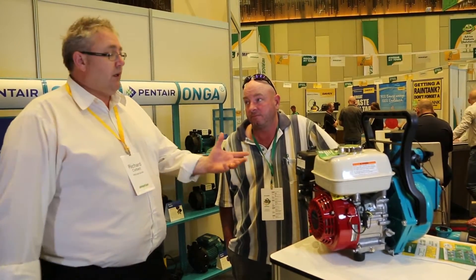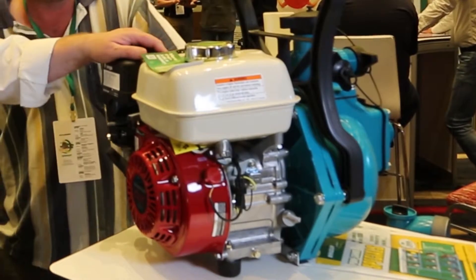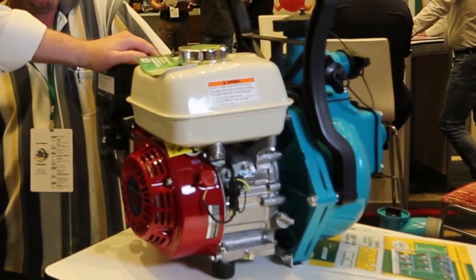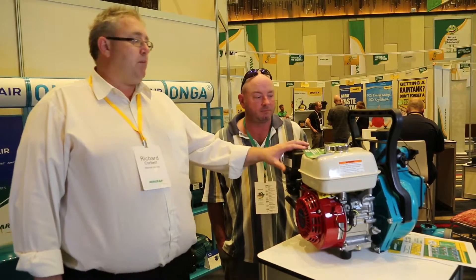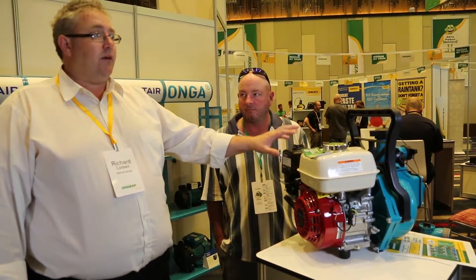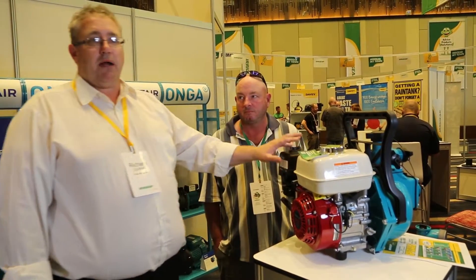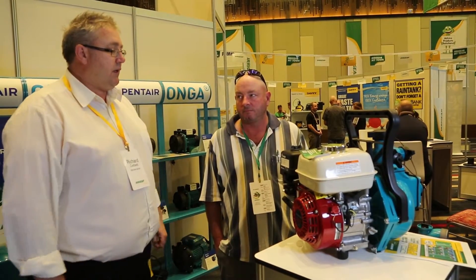So that's hence why most firefighters are engine drive. This is what we call a B55H, which is a single stage firefighter with a Honda GX160 motor on the end of it. A very reliable motor, and that's why we put that on our wet end — because if you're ever going to have a problem it always comes from the engine end, and we need to make sure this part's working very well when they go to use the pump.